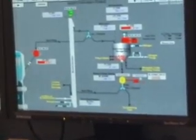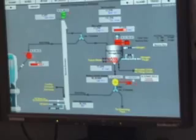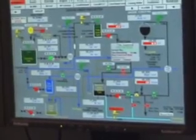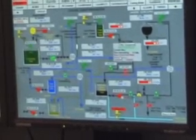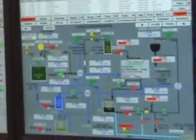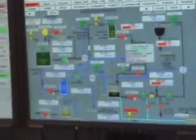That's where we take the pellets that we make and get dissolved in the dissolving tank. On the cooking liquor preparation page, it goes to this dissolving tank — that's a different area we don't operate; the pulp mill operates — but they dissolve the sodium in it there, and it goes through a series of heat exchangers and over to this press. They press out the liquor, separating the liquor and the carbon basically. We have the cooking liquor that goes back to the mill, and the filter cake at the end of it all gets in a dumpster and is removed. So that's it in a nutshell.